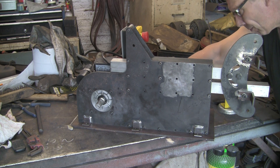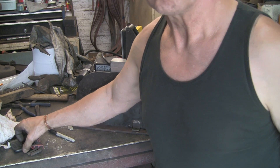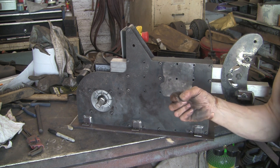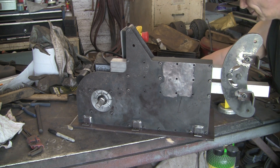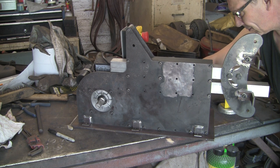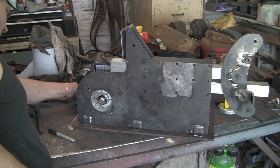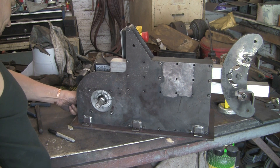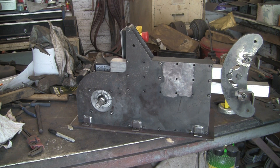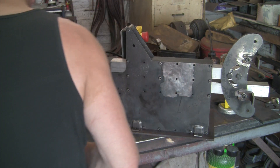I think I've got it lined up where I want it. I'm just going to use my Sharpie through the holes just to mark where they are. Do the same the other side. Unfortunately I can't get to the motor holes because they're under the actual motor body, so I'm just going to quickly make a little bent scriber - a little bit of stainless steel - just so I can get under the body of the motor to scribe the feet holes. Do the other end, and that's it.